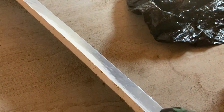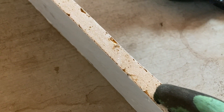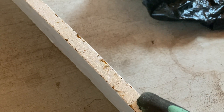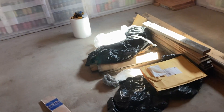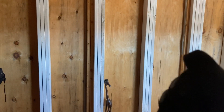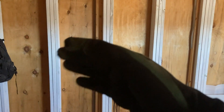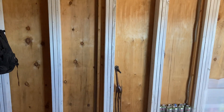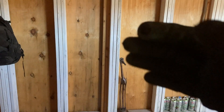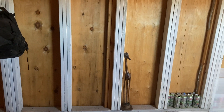That's where you're really getting your thermal resistance. If you look closely at this polyiso, all these tiny little nooks and crannies and holes in it — that's trapping air. So with this in mind, let's take a look at these cavities. If we can get these cavities pretty airtight so that air is really trapped in there, that alone with a 2x6 cavity could take us up to pretty close to R20. If we round down to R3 per inch, that's still R16.5 — still pretty good.